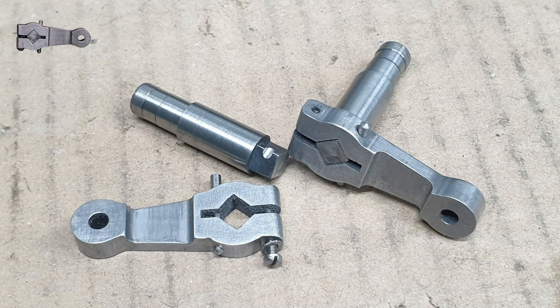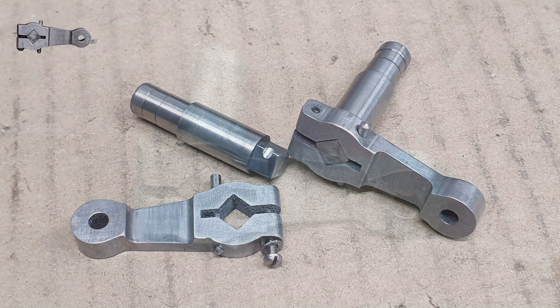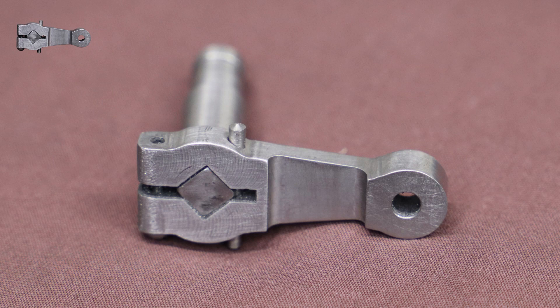To finish off, a few minutes with the needle files and some emery cloth was required, and I also needed to put that little nick on the corner of the crank pin, which you can hopefully see in the picture. This was a lot of effort for two very small parts, but I think the results are good. In the next video I'll cover off the refitting of the crank pins for the driving wheels in the correct position.